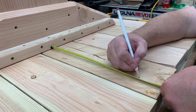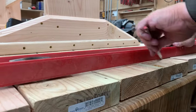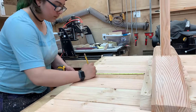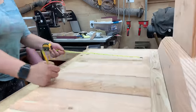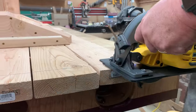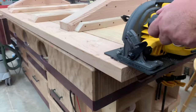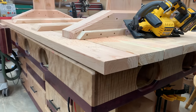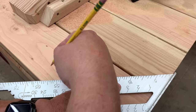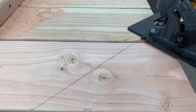The table is nearing completion. I'm going to cut the ends off — I bought eight-foot boards which is what I always do. They usually have checks and splits at the end, so I always cut some off. I think I'm going to cut about three or four inches off each side and have a table that's maybe seven-and-a-half feet. After I draw a line with a straight edge, I'll go through with a circular saw and cut it off flush all at once. That square look on the end doesn't really fit with the chamfer theme, so I'm going to cut the corners off at all four corners — that really adds a nice touch of class.